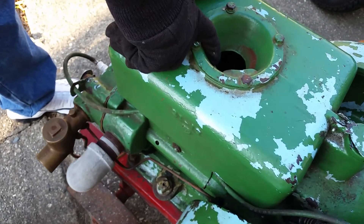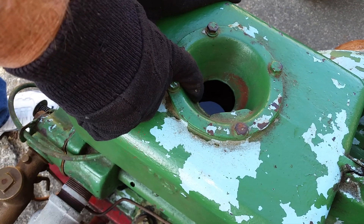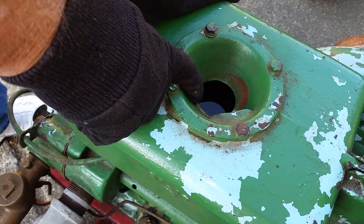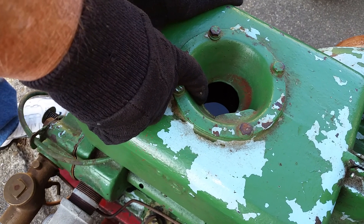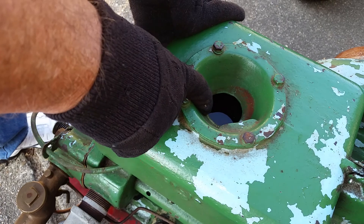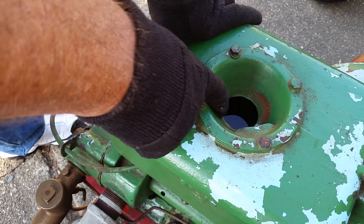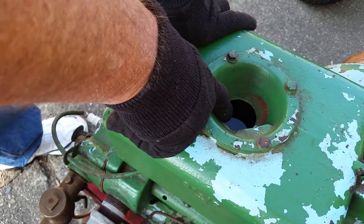This is where you have water in your coolant. It's supposed to be filled to at least three inches from the top. There's no water pump so this gets hot — it steams and sometimes it boils. That's okay. But what you're supposed to do is keep track of that level over time and make sure that it's within three inches of the top.